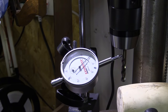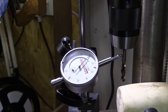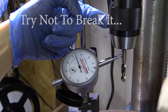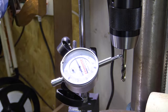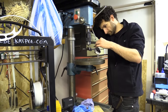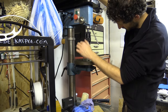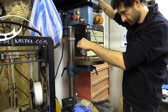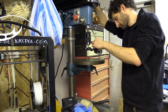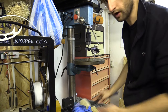I've managed to set it so it's about 0.25mm deflection. It really is about hitting the chuck as hard as you can with a soft mallet so that it seats properly into the Morse taper. The last thing I did was tram the bed using a dial gauge clamped to an arm across the chuck, and used a hammer to adjust the tilt. I've got it to about 0.05mm.